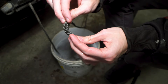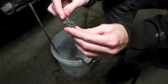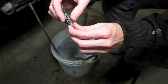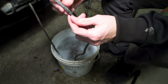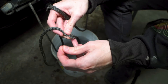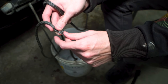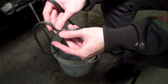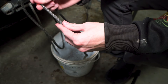Here is a good example of what we'd expect to see in synthetic line. You can see it's fraying with a little bit of fuzz, but when I push this together I can look at each one of those lines and make sure there's no breakage or structural integrity lost. It's going to be a little fuzzy but just make sure you don't have any breaks. Right here you can see a little tail that's probably an eighth of this strand — I'm not too worried because the main strand is still fine, but this is something to watch. If you start seeing more and more of this, it might be time to replace your synthetic rope.